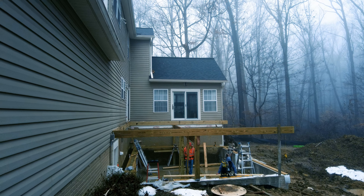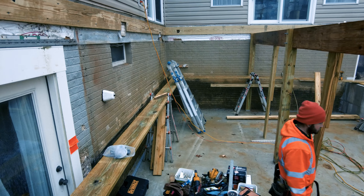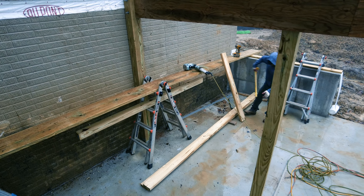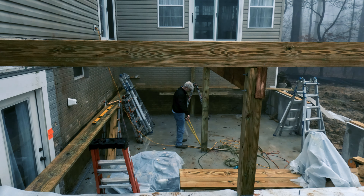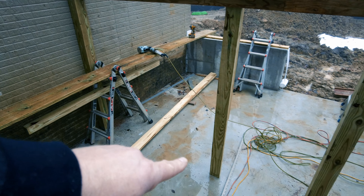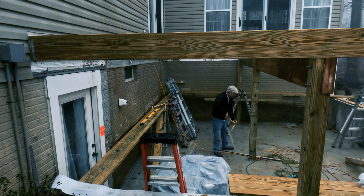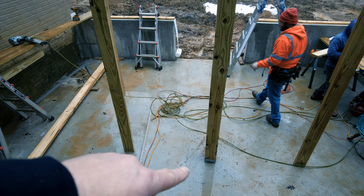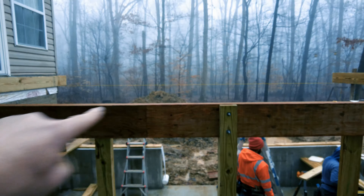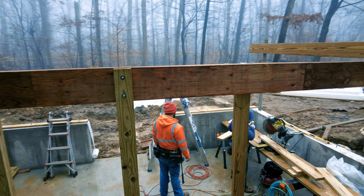I can explain that after the framing's up and we start to lay that down. We had some integral footing support underneath the slab. For some reason, we all missed this — concrete guys missed this. They just happened to pull the wrong measurement off of this post here. The footing was actually poured where I had this temporary support, where we actually needed the footing under this post here. So a few options: we could always beef up this beam and then move the post over to where the footing is and calculate the span that we need.